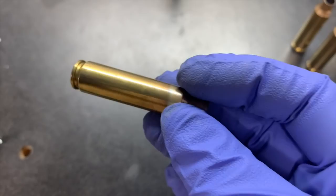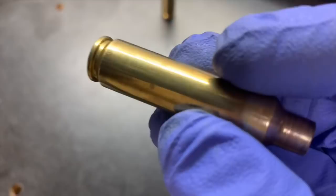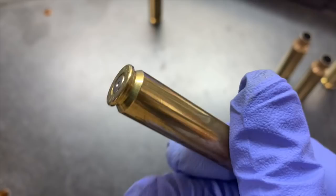This piece is from a different batch of brass, same number of firings. You can see no indications on the outside — this is just normal looking brass, nothing weird about it. Let's take a dive inside and see what it looks like. Here we are inside, and you will see no visible line. There's the bottom, you can see the flash hole, coming back up — nothing there, no sign of any issues. There's the shoulder and neck junction, and that's it — clean as a whistle inside.